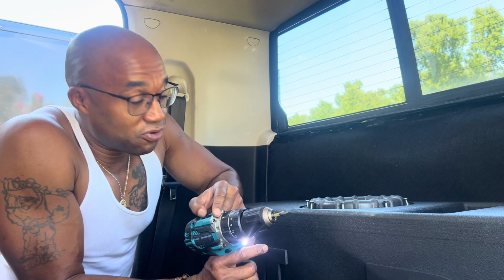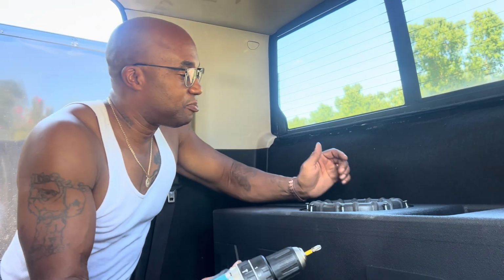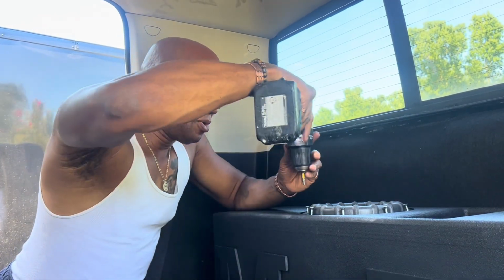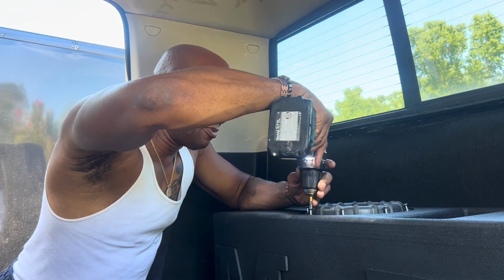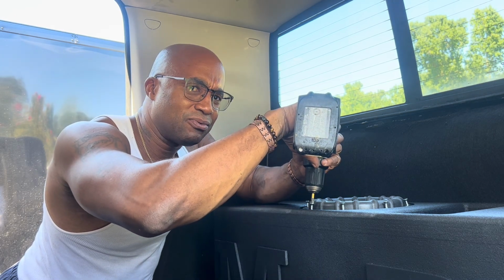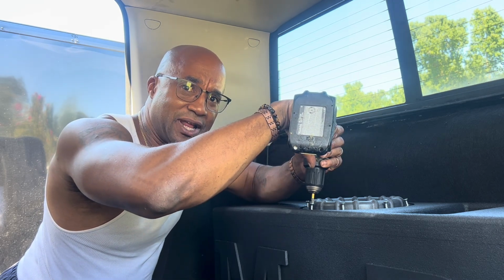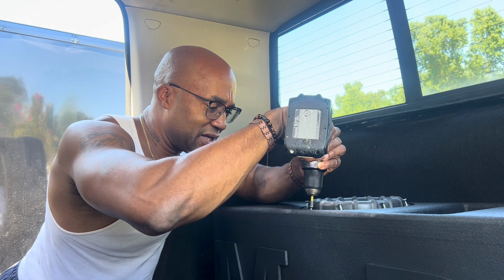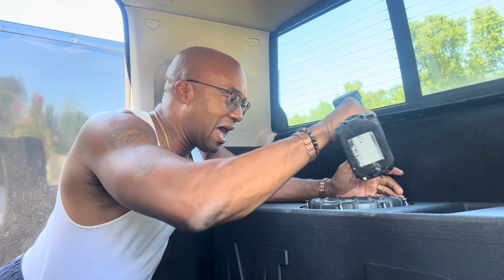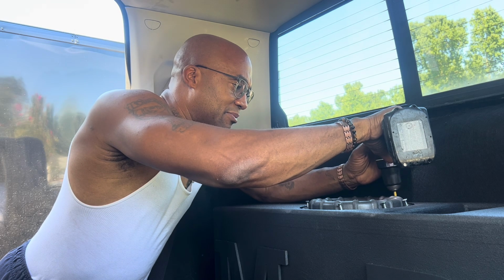Otherwise it's going to fly off and hit your surround. Now, since you positioned everything, do not go straight down, especially if you didn't cut the hole yourself. Position it at maybe a 10-degree angle. Use one hand for guidance. Slowly, let it bite, but do not tighten that screw all the way in. Go directly opposite that screw and get a bite. Same thing.